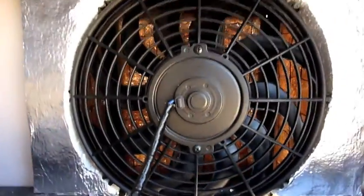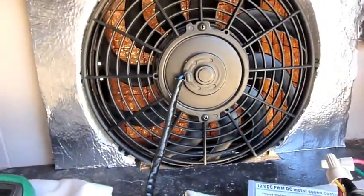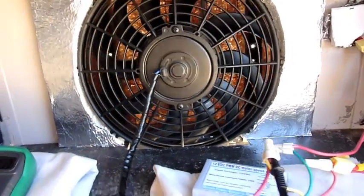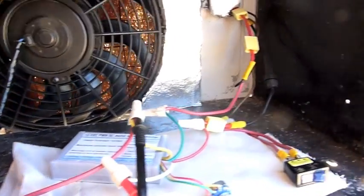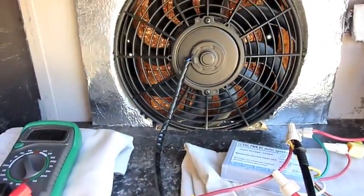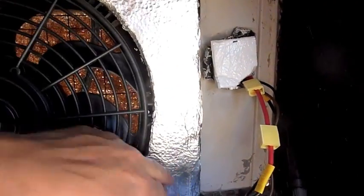The second part of this is the actual DC radiator fan. It's mounted in place exactly the way Jim's plans suggested. I also bought some inch-and-a-half foam insulation, cut it, and pushed it around the edges of the fan so that the fan would truly only be sucking air through the moistened pads and not drawing in warm dry air from around the sides.